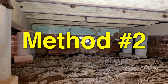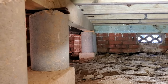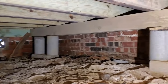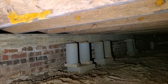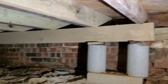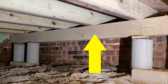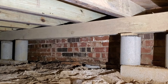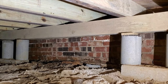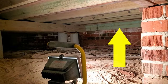Here we are under another house with a different pier and beam foundation where there's been a considerable amount of piers added. This new beam runs along the outside wall. Essentially, this foundation is now a floating foundation where this is a structural part. The outside brick you see there — the stem wall — is no longer load bearing as it once was; it's a shared load. We've also replaced all of the rim joists along this section.